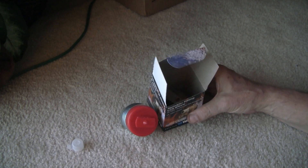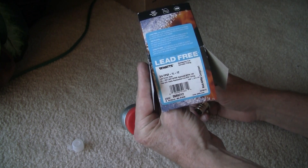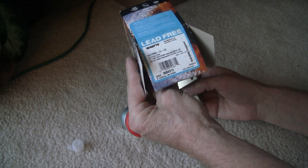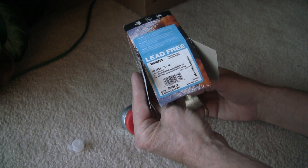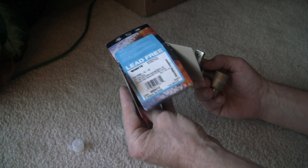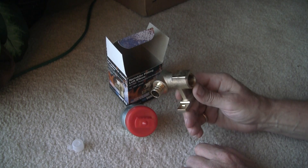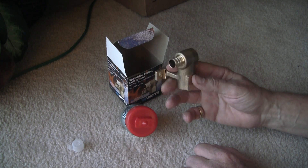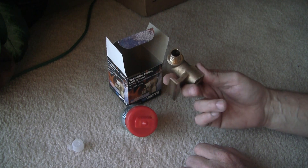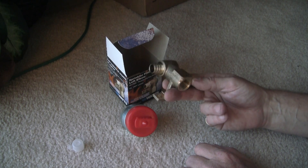These are the two main elements of the fire system, other than the piping itself. This is a Watts lead-free fitting — it's basically brass. With the lead-free fittings, they've taken out as much of the lead as they can, which is important when you hook this up, especially if it's connected to a domestic water supply system, because you obviously don't want any lead contamination in your water supply. This is going to go downstream of my domestic water supply.